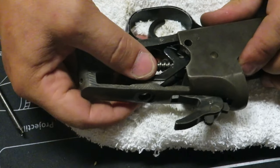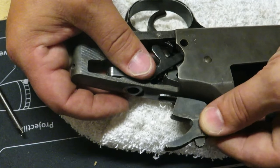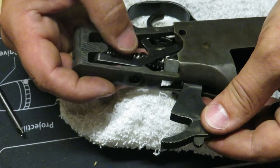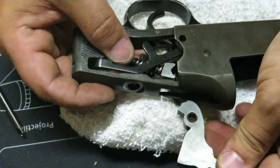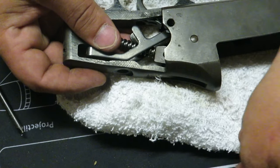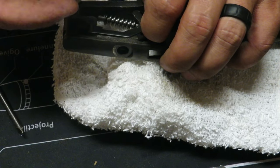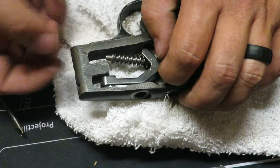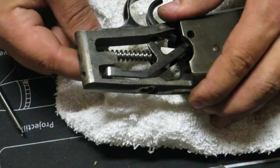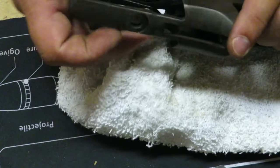Your connector arm is ready to come out, but first pull up on the hammer and your hammer will come out. Push the pin all the way through, lift up on your hammer, get your hammer out of the way, set that to the side. Now your hammer spring is ready to go — these do come apart here. Pull that out like such, set that to the side.